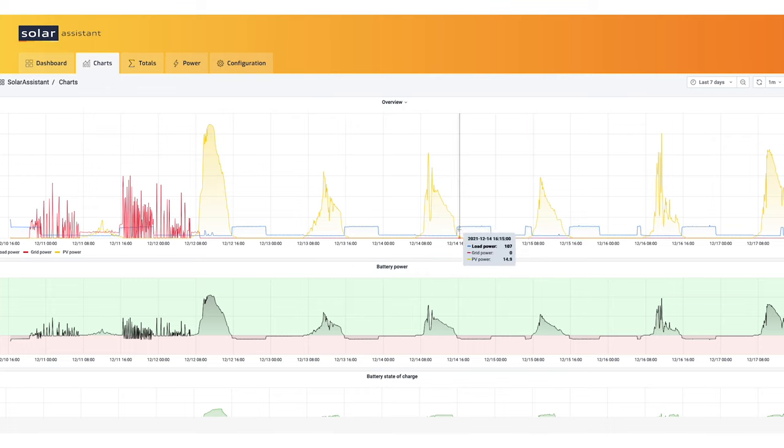And you can see here, this is from night. This is basically from 3:40 in the afternoon to about 11 o'clock at night. And then sometimes we turn them on a little bit in the morning. And it just repeats itself. These red lines here are very interesting. This is where the inverter is calling on grid power to help charge the batteries.